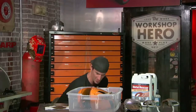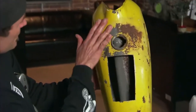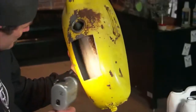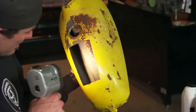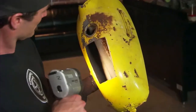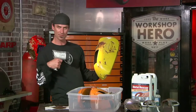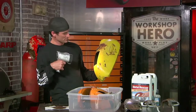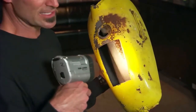We've already done a tank, and we cut it open so you could see inside. Look at that — all that rust is gone on one side. It's really pretty. All that patina is there, and for guys that love patina, this is just the most perfect way to do it. Look how clean that is — perfectly clean on one side, and then you get to the other side and it's just full of muck. This thing really just pulls rust from the metal, slowly pulling it back into the water solution. Now, color won't matter, except on some red colors — you might have an issue because of the red oxide in it, since it does attack iron oxides. If you're really worried about it on an expensive red tank, just do a little test somewhere you're not worried about. Nine times out of ten, you're not even going to have to worry about it.